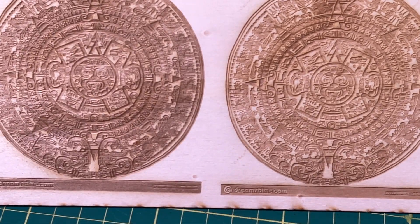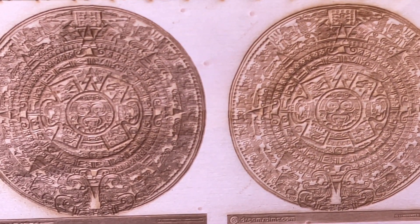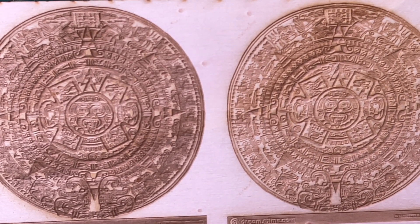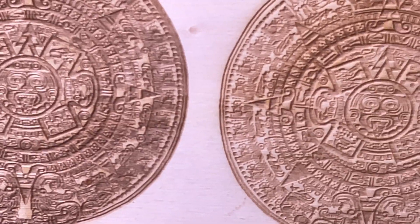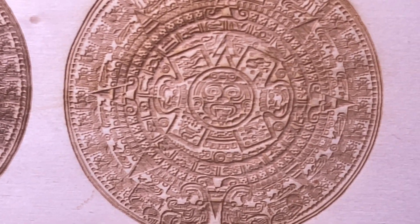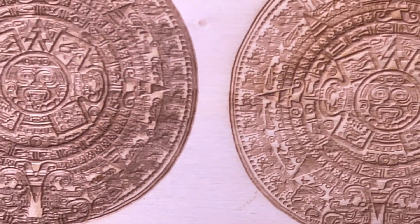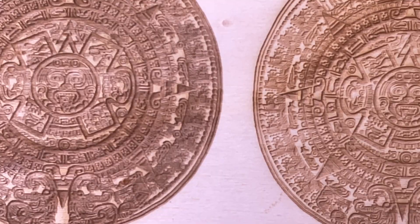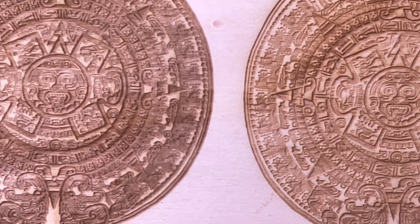Just a quick look at the engraving. The one on the left is the five inch lens, the one on the right is the two inch lens. Both are actually really good, but if you look closely, some of the finer details are just not quite as sharp on the five inch, whereas on the two inch, even the ultra-fine detail in the inner ring is really very good. On the five inch it's just a little blurry on the inside. So which one is better? There are reasons why you'd want to use one over the other.